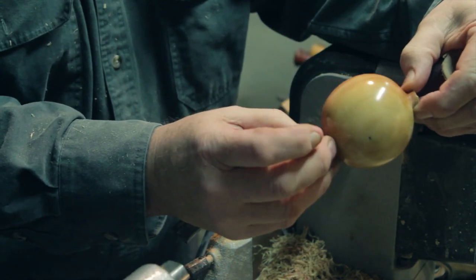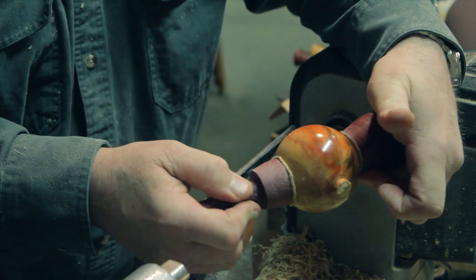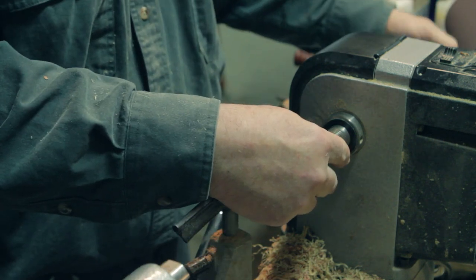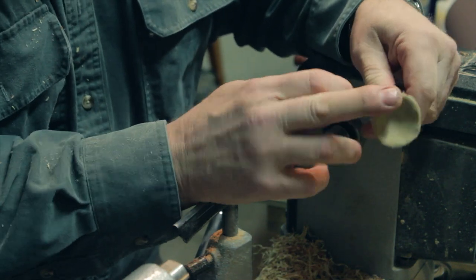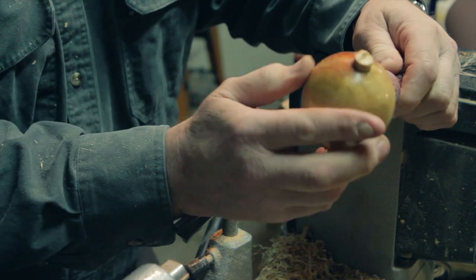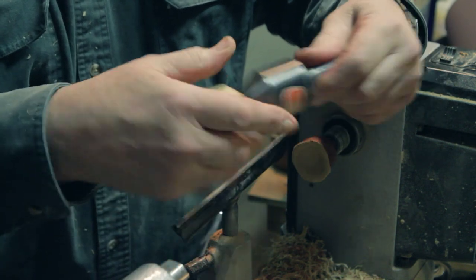What I've done is cut off the ends that held the piece in the lathe. The question becomes how do you finish the sphere? The answer is with something called cup chucks — chucks that hold the piece without actually penetrating the surface. The cup chuck can be made in various forms. I like the one with the Morse Taper 2 on the end that fits right into the lathe, but you can use a standard four-jaw chuck as long as it's got the cup part. The cup is deep enough that it only contacts the sphere in a circle around the outside, and the pressure of the two circles holds it in place.